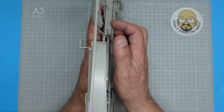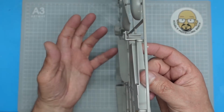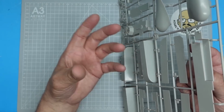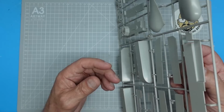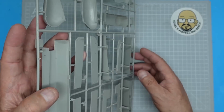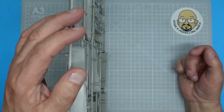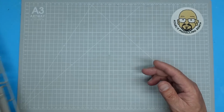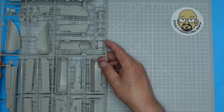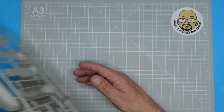And then once that's done, the plastic stops injecting, it has a curing time, and then the tool opens, and then obviously this will stick to the tool because it's an exact male copy, if you like, of a load of female shapes, or vice versa. So you have to have what's called ejector pins. Sorry, we don't have to have ejector pin marks, we have to have ejector pins that actually push the sprue out, and then an operator either grabs the sprue and puts it in a box, or it will just fall, and then they all fall on top of each other, or a robot will come and take it and put it over in a rack or whatever.